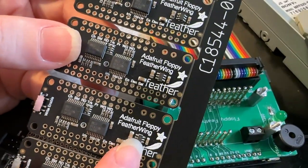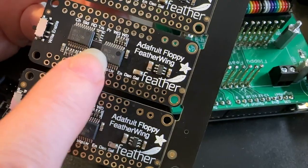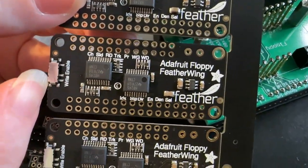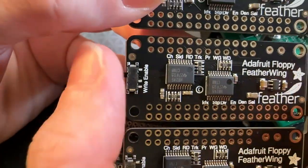There's a little boost converter here — a switch cap converter — that gives me a five volt signal. The power comes separately, and then I have a write enable switch so you can completely disable the ability to write to the disc, which is great for archiving.